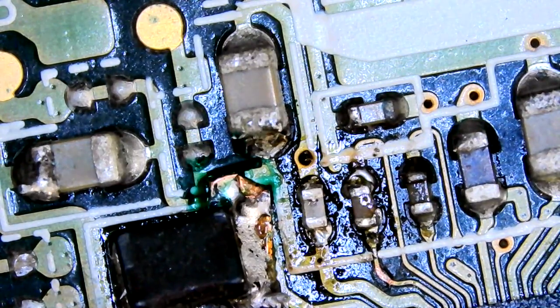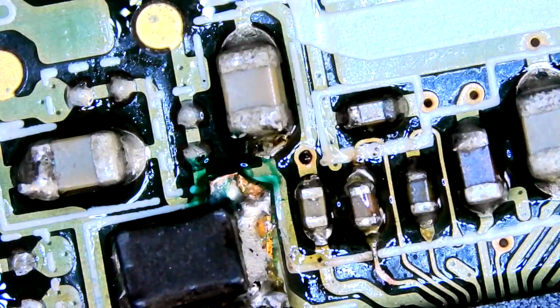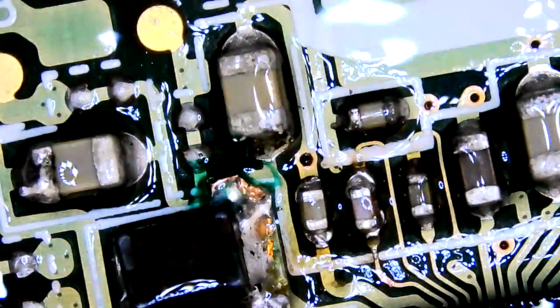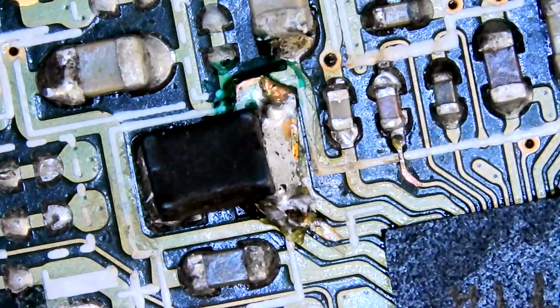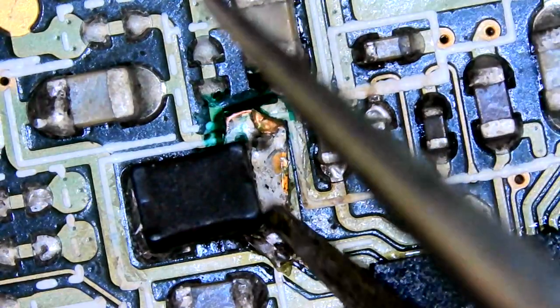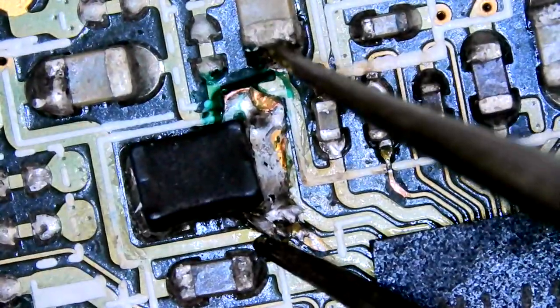Probably give it a clean, and then probably put mask on again, I'd say. I think I should remask it, especially that exposed trace that I ground off. Should definitely mask it up. And hopefully I don't squirt too much out, because last time I tried to use this thing, because it's a fairly full tube, it's the Mechanic UV curing solder mask. I've got that in a tube or a syringey thing, and it's quite full, and the tiniest bit of pressure on it brings so much out. I always dispense way too much every time I try and use it. I've got to wipe so much of it away on the tip of the syringe. So let's try not go overboard with it today.